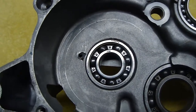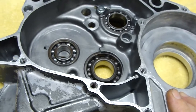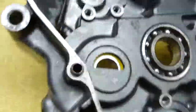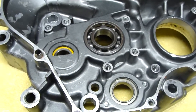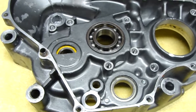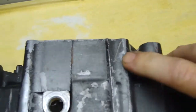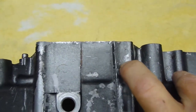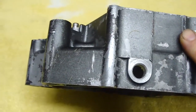A screw thread is basically like a hydraulic cylinder. If you get grease, dirt, silicone, sealant, or whatever built up in those threads, it will push it out somewhere when you tighten the screw down, and it will push the aluminum out. I've seen a lot of them push out right here. I had one that was broke way down here with a little bit of sealant pushed out — but it's just hydraulics.